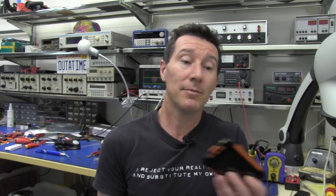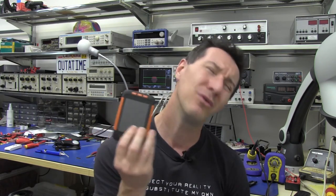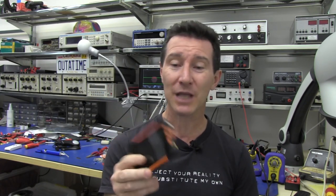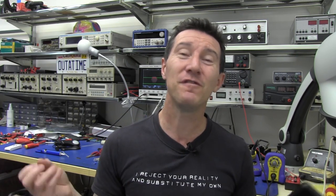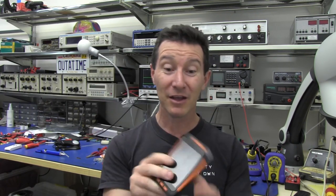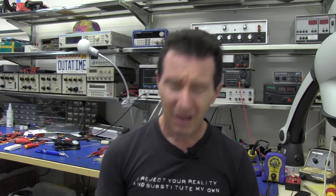It's a bit of a shame because I think there's a good market for these pocket DSOs. If somebody designs and builds one properly and puts a bit of work in it — even if it costs $150 — fine. But don't bother with this one, even as a first scope. Go get an analog scope instead. Even just to throw in your toolbox and view a basic signal — it practically fails at that. There's no working battery indication, no AC coupling, it's buggy, the attenuator is all over the shop, it doesn't even get close to its bandwidth spec, single shot capture is broken, and the menu system sucks.